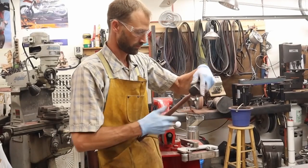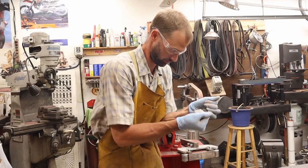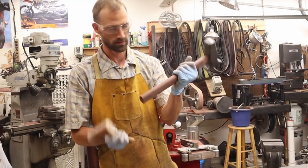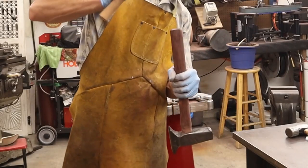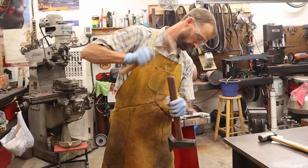It's quite interesting how you install a handle on a hammerhead or tomahawk. I flip it upside down here and hammer the bottom of the stave — what that actually does is drive the hammer up onto the handle, giving you an incredibly tight fit.